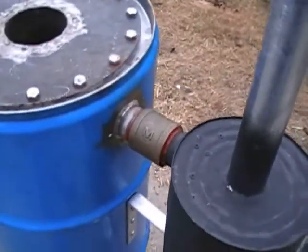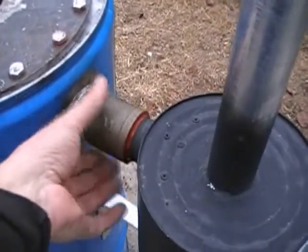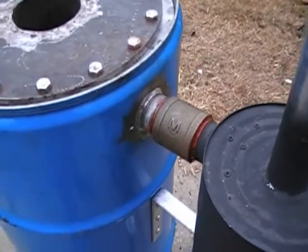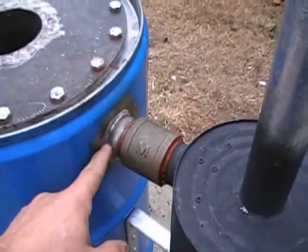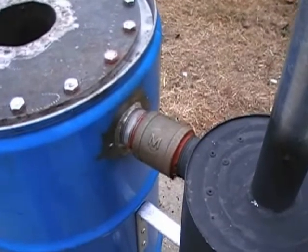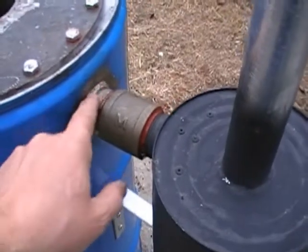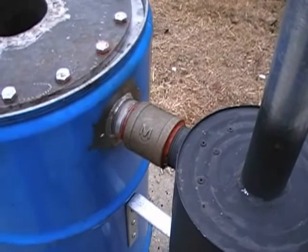I also want to note something here. The way I cut this hole, I was able to screw this piece in — so I didn't have to weld it, or even use anything but RTV cement. I chose instead to use high-temperature solder rated at 450 degrees. The hottest I could get this thing was about 330 degrees, and the solder never even got soft. So it actually turned out to be a damn good seal, and it's got some good tensile strength behind it.